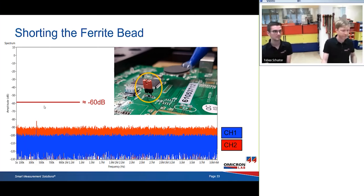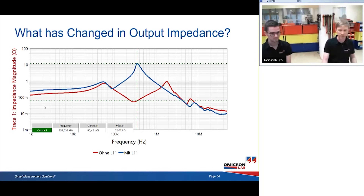We also want roughly 5 dB of noise floor improvement by removing the ferrite bead directly at the supply of the chip. What happened to the output impedance? You can see in blue the output impedance curve from before, and in red the new output impedance curve with the shorted ferrite.